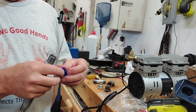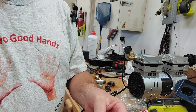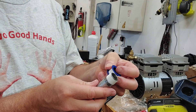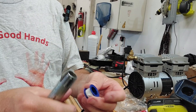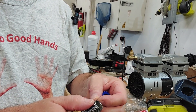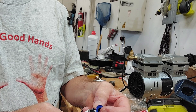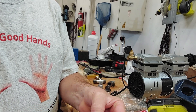The first thing you do is get your plumber's tape out and do a couple wraps — just pull it tight and break it off. You can do all your ends this way. Just make sure you turn the pipe clockwise so that you don't unravel the tape when you go to actually screw it into the pipes.